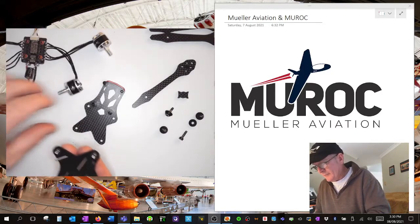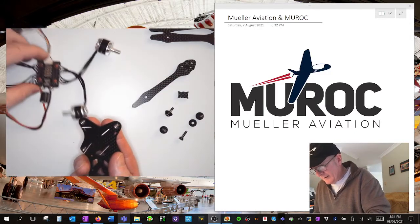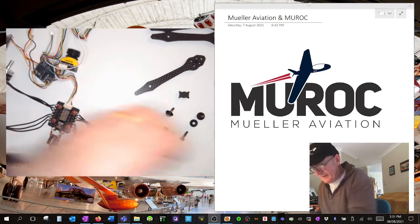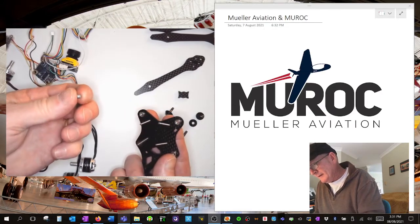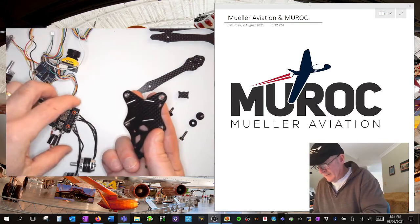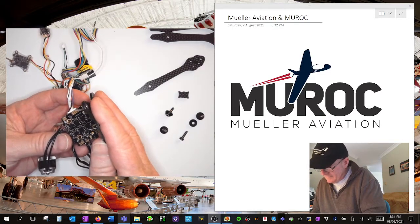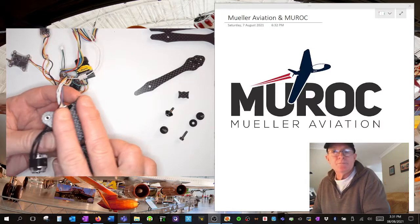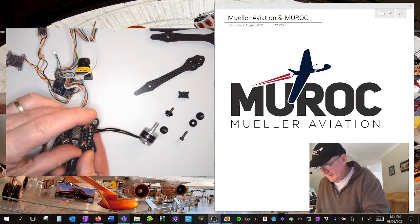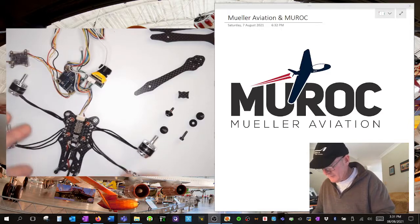Right, now this flight controller, first of all, go off to one side, come back to you. This flight controller and power distribution board are going to mount down onto here. And these are going to go on top of everything to secure it. These little nuts with the nylon inside to lock them off. Lock it in. So first of all, the power distribution board's going down. Careful again, every time I touch this jolly thing, I weaken the solder joints, but there's not much I can do. Come through, like that. Put my hands over the top. Grab all those four, hold them all together so I can gently lower it down. There's my PDB down, power distribution board.